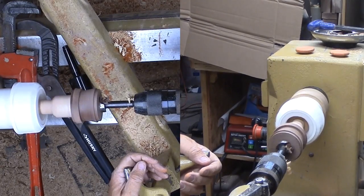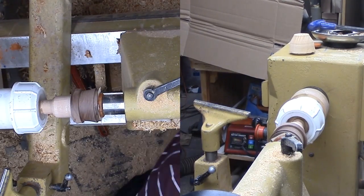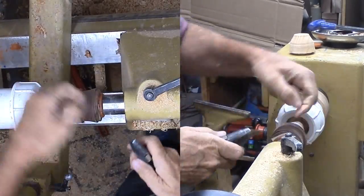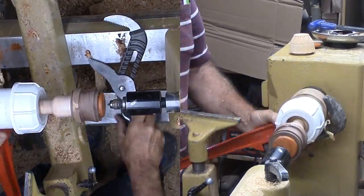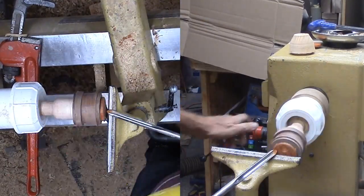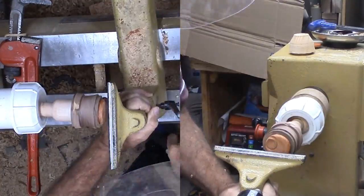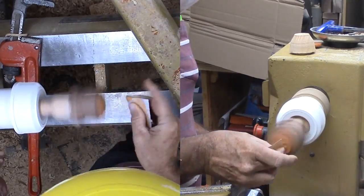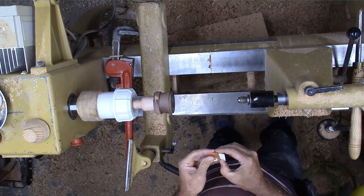Now with the infinite axis chuck, I'm modifying the work pedestal surface by drilling a shallow mortise to fit the tenons on the padauk workpieces. I feel this will give me a measure of security later when turning. Then I fasten the first piece with double stick tape and tail stock pressure, and position the chuck for the first feature. With a sharp small gouge, I'm cutting in this feature, then gently sanding the fresh wood. Now I reposition the chuck for the second feature — the live center points to the center of the feature. Again with a sharp small gouge, I cut a different shape and sand. Then I mount the second piece, which will have three features — because I feel like three on this one.